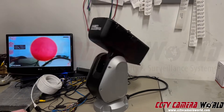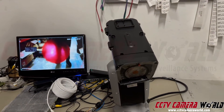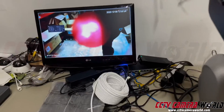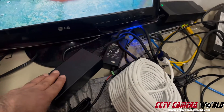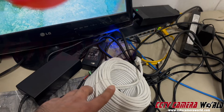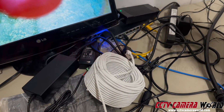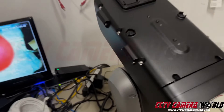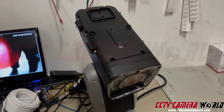The important thing is the power supply needs to be plugged into a stable 110 volt outlet. Please make sure you're not running it off a generator or some other portable source of power. This thing is pretty beefy and needs all the current it can get sent over. However, if you have too long of a CAT5E or CAT6 cable, or it's not solid copper, you're not going to get the right amount of current going to the camera. It's not going to have those fluid movements — it's going to stutter, or it might actually just not turn on properly.